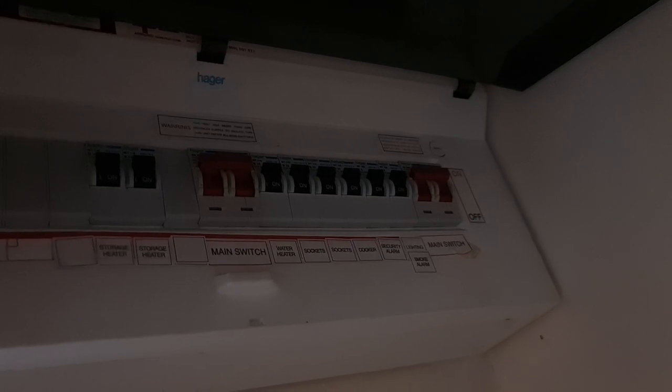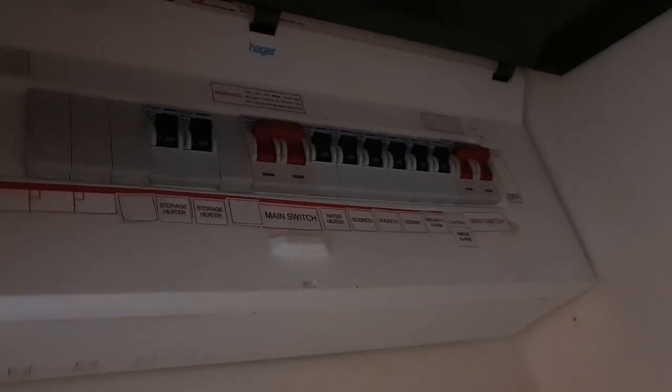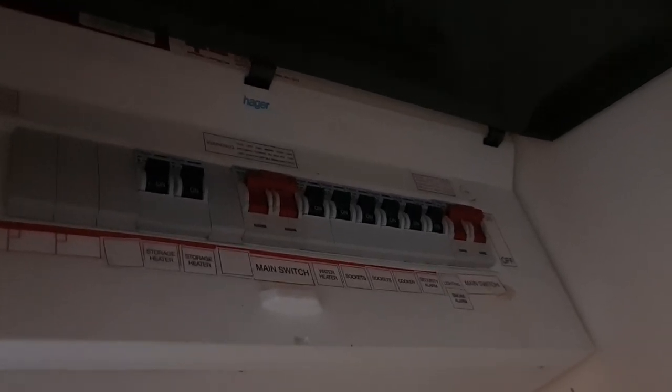And then I can be safe in the flat anyway because there's no one else in here. But for that absolute 100% protection to anything coming into this consumer unit while I've got it open, I can go out into the riser cupboard as I have done, lock off out there and make sure everything's totally safe. I've then got the key for the cupboard and the padlock and work safe. Always do that. Make sure everything's dead before you become dead. And your dead tests can all be done in a safe manner. So yeah, that's that one.